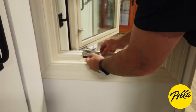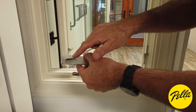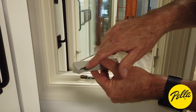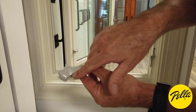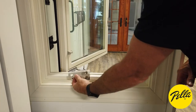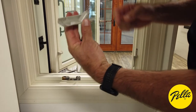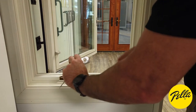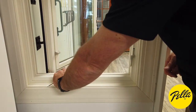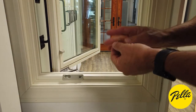To put it back on, you'll just set your cover in. I want to note that Pella puts 'Pella' on most everything — you'll see 'Pella' right there. There is a left and a right to these, so you cannot put a right on a left hinge window. This is a right hinge window here, so they're not universal. Pella should always be up — if it's down, then you have the wrong side.